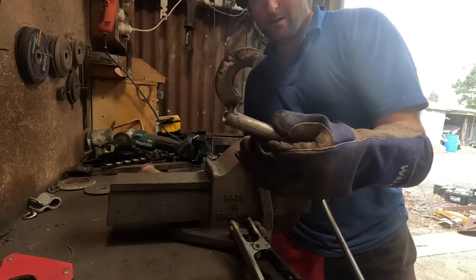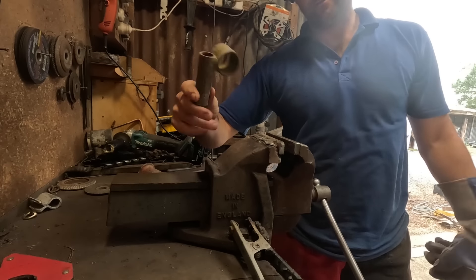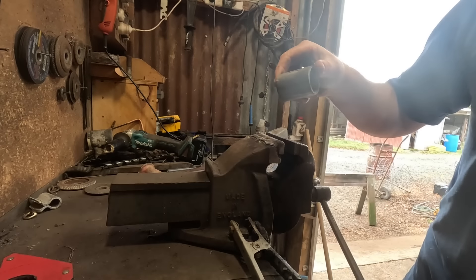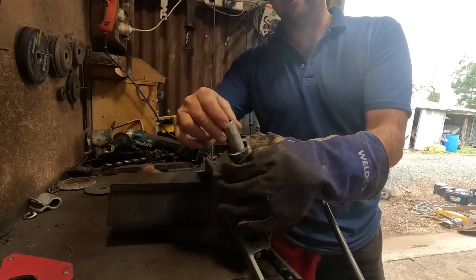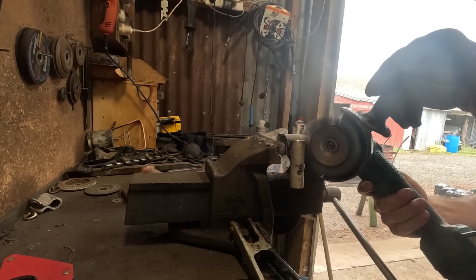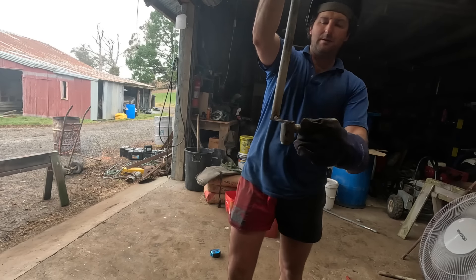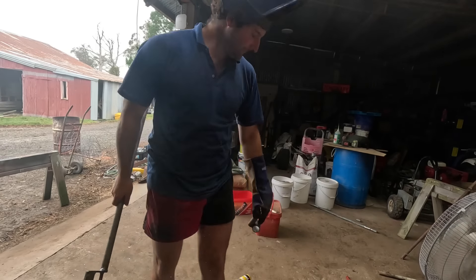Move on to the bottom part. This is what we're making to put the foot of the cam lock gate in - it's two pieces of pipe. One is a 25 mil pipe, 90 mil long. This one is 50 mil long and 40 mil in diameter. You just need to make sure that you can put the bottom of the other one inside here, because that's what holds it when you use the cam action. We'll weld these together. You want it so it sits on the bottom of the post, this comes in here and sits on the top, and it needs to be able to swing around that bottom piece.